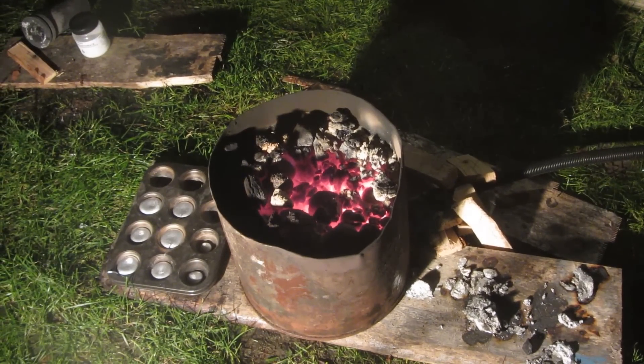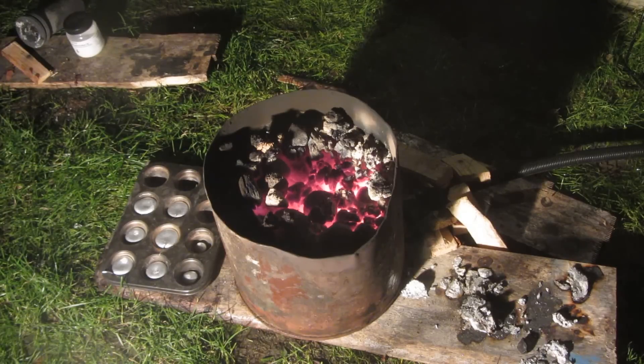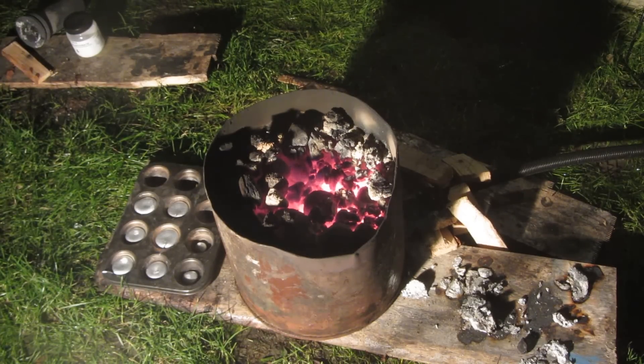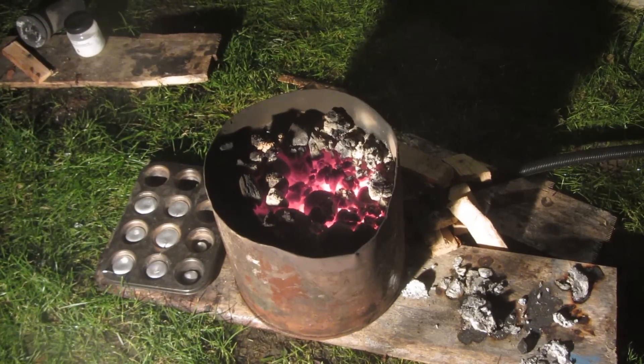The first thing you're going to need is a forge. This is a coal-powered forge — I've also been using it to melt aluminium, and there's a link in the description to my aluminium casting playlist. You just turn on this blower to supply lots of oxygen into the fire, making it really hot. It's a bit large for this project so I'll be careful not to overheat it. There's a great tutorial on making a forge like this by Grant Thompson the King of Random, or the soup can forge tutorial by Nighthawken Light — I'll link both in the description.